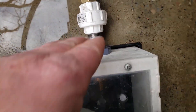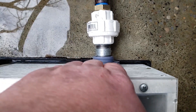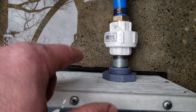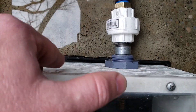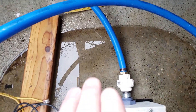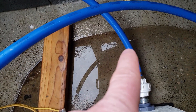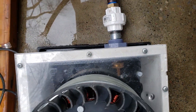My idea for alignment is to cut a larger hole here and put this on another plate. The plate is going to be slotted in one direction and the mount slotted in the other direction, with adjuster bolts that can move the plate up and down, left and right, to fix the jet alignment. I'm also going to — at least for this temporary version — put in the corner braces for PEX that make it a sharp 90, so that'll remove the stress of the PEX being bent on this. That should fix a lot of the problems.